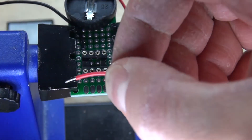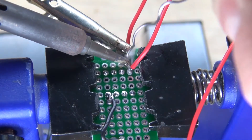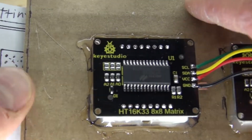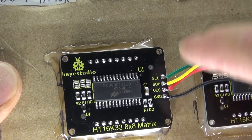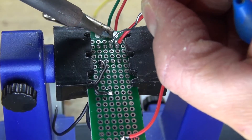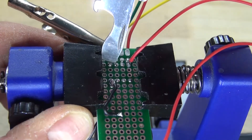Take the positive wire and connect it to pin 8. Clamp it down, bend over the lead, solder it into place, and solder bridge it to pin 8. Following the schematic: SCL connects to pin 7 (the green wire) and SDA connects to pin 5. Connect the SCL wire to pin 7 — place it in, clamp it down, bend the lead, solder it into place, and solder bridge to pin 7. Then take the SDA wire, place it on pin 5, bend the lead, solder into place, and solder bridge to pin 5.